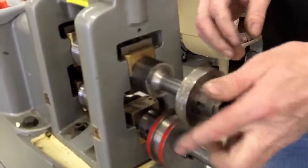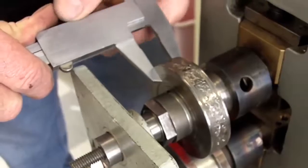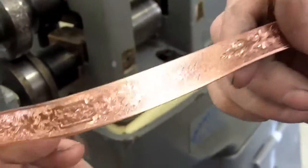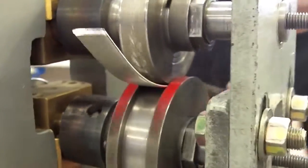We take them over to the rolling mill and mount them on there. We make sure that the clearances are right and the die and its follower are aligned properly. We cut a piece of copper to run a test and if everything is fine, we go to silver. If it's not fine, we find where the problem is and do some adjusting.